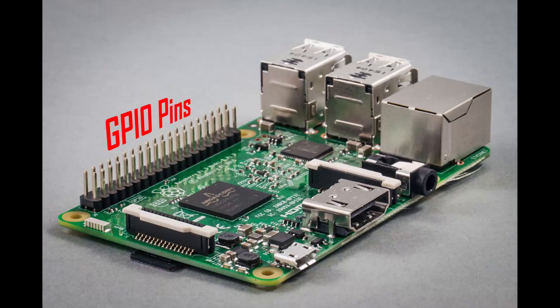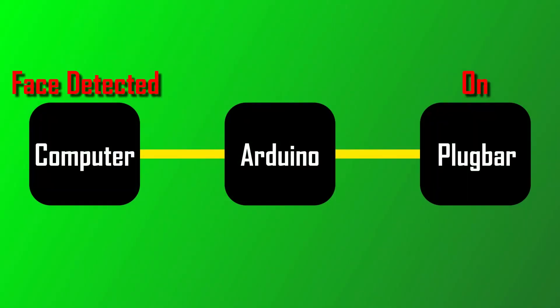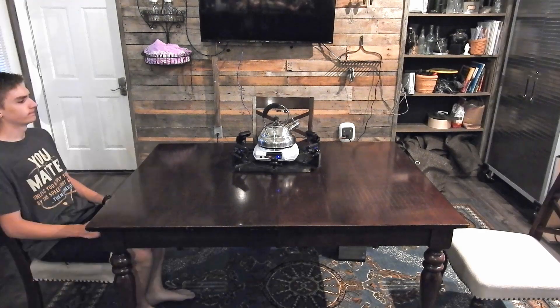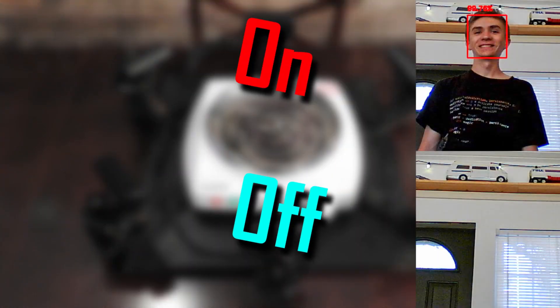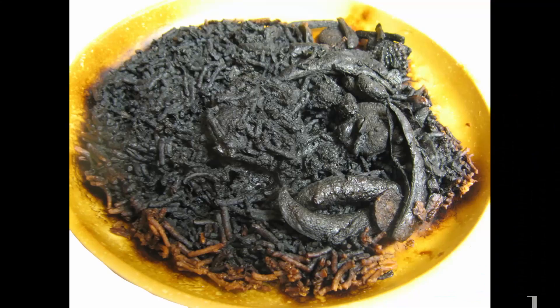Since I no longer had access to the GPIO pins of the Raspberry Pi, I had to find another way to trigger the plug bar. To do that, I simply slaved an Arduino to the desktop, then connected it to the plug bar. When the desktop detects a face, it sends a command to the Arduino, which then deactivates the plug bar. In terms of overall performance, the V2 performed quite well — although it still has some blind spots, its visual coverage is a drastic improvement over the V1. Another great thing about this contraption is that you could easily invert the logic to create a safety measure, which would deactivate the burner unless it sees your face, making it less likely for you to walk away when cooking and burn your food.